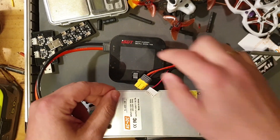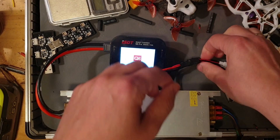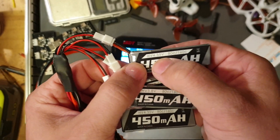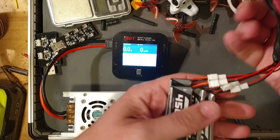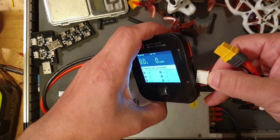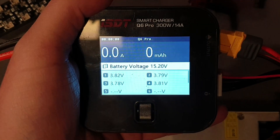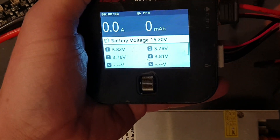I'm going to fire up my charger. There we go. Now these here are the same batteries with the same capacity. These ones here are the high voltage ones — 4.35 volts. So just in case one is not a high voltage, I'll plug in the balance connector. I'm going to zoom in a little bit so you can see it. And then the XT60. There we go. Perfect.